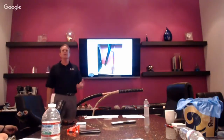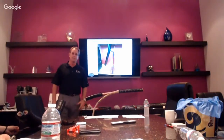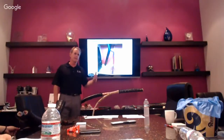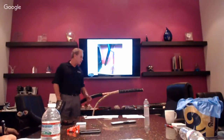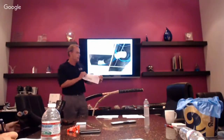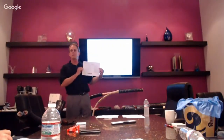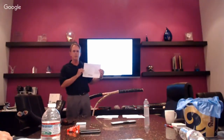And the first thing anybody says, well, can't you try? Yeah, who's paying if we break them? The bundles, not the pipes. But they need to put them into specification. So this is an underground spec. It's important to note that this is valid even overhead, with the exception you're not running PVC overhead. It's going to be some type of metal. But the PVC doesn't meet smoke or fire or some of those things. But you still got to have the 24-inch radius.